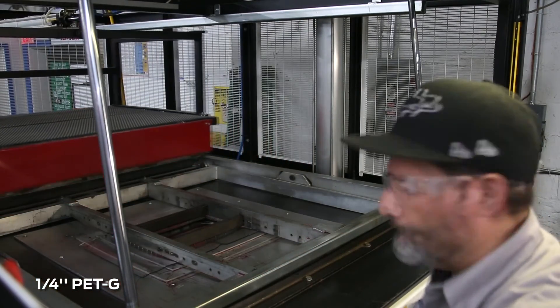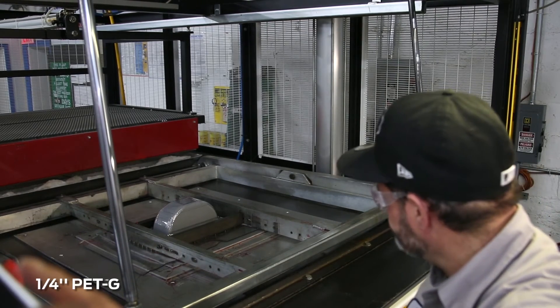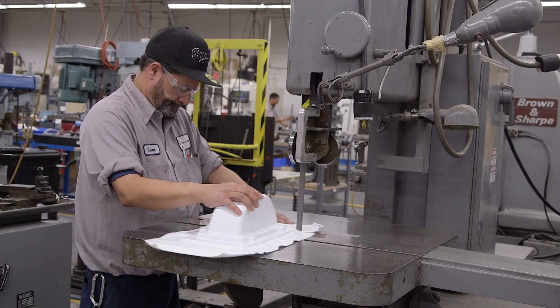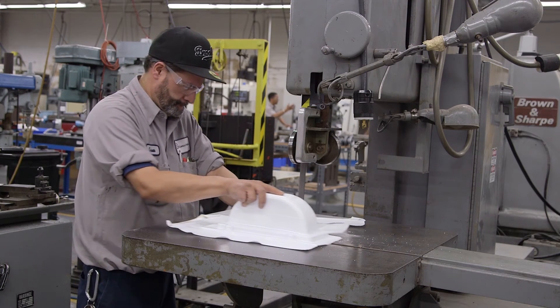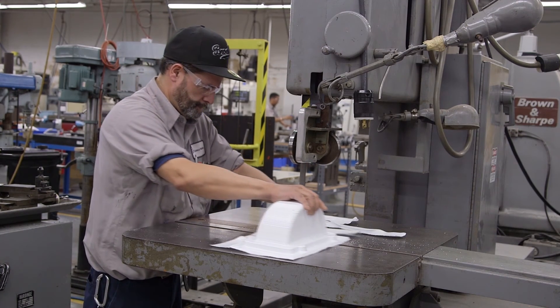When examining your final parts, look out for slight imperfections such as deformation or webbing that can occur when the plastic is overheated, stretched, or left on the vacuum forming platen for too long. After you have successfully molded your object, any extra plastic will have to be cut away — this is called flash. Industrially, this material is cut away with a computer controlled cutting device, or manually as shown here.